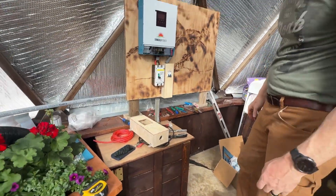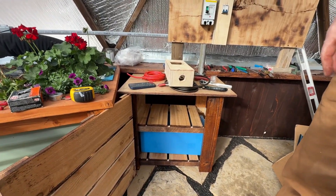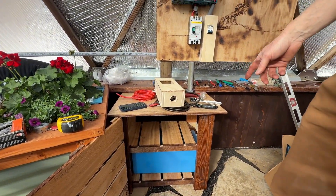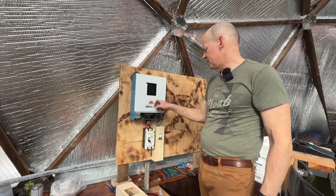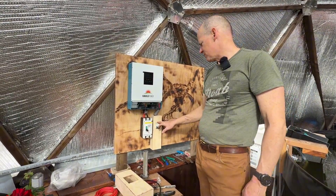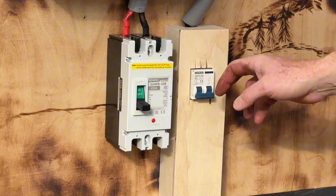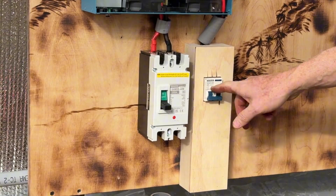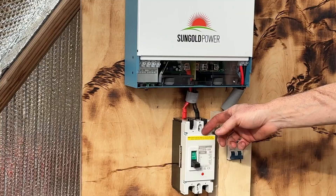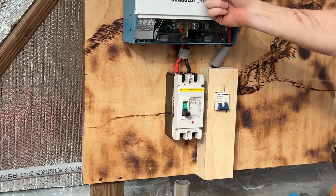Let's talk about the batteries. There's two shelves, one for each battery. They just get wired in parallel, and then those wires come up into here and into there. That's your solar charging coming from outside — it comes in here, goes through the solar breaker, and then into the panel. When we're charging the batteries, the power is going that way. When we're using them, it's coming out that way. It's a fairly simple setup.